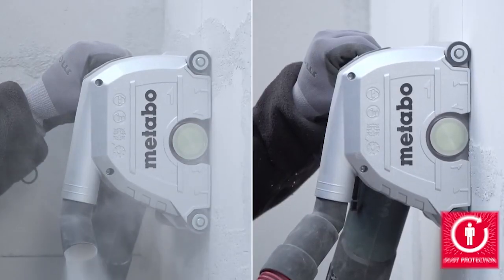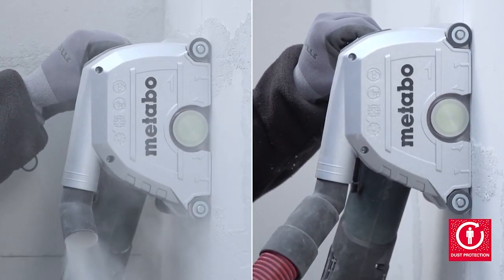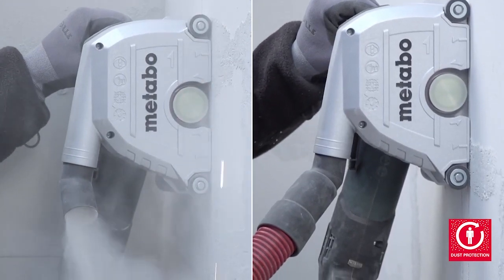What's the alternative if you don't have this tool? It depends. You can use an angle grinder and a diamond blade to make the chase, but it creates a lot of dust. This is totally dustless with the vacuum system — you hook this to a vacuum. It is OSHA compliant. We have five-inch discs and any vacuum with at least 125 CFM — you are OSHA compliant and doing your chase.